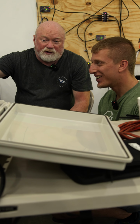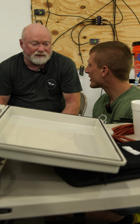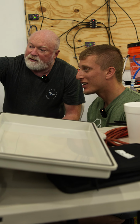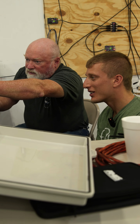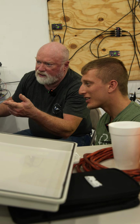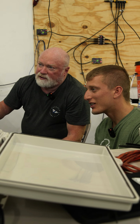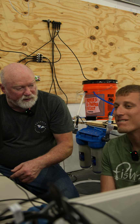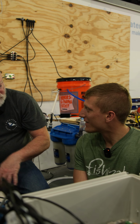If there's no water pressure for flush, it won't flush because there's no water to flush, okay? Yeah. And then all of this stuff is logged, but you can set here the flush timer, whether it's on or off, or it flushes after every cycle. And then here you can set the freeze cycle too. So if you're in the Arctic or so, you can say every 30 minutes run for 5 minutes, salt water to keep everything from freezing out through the outflow, okay?